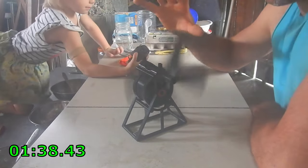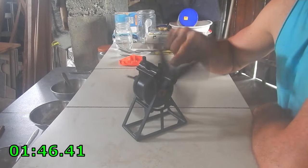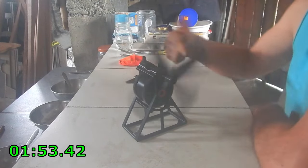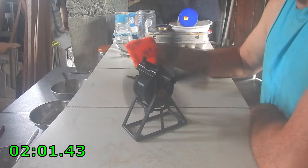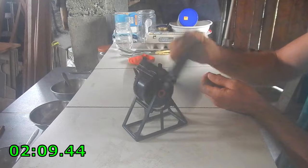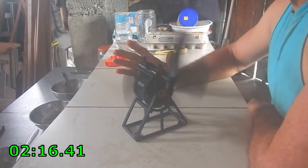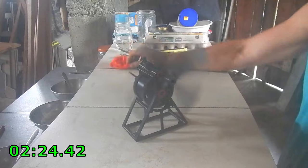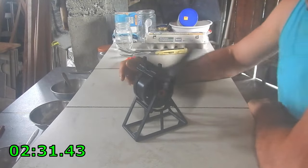Most of the parts here are 3D printed, obviously. The non-3D printed parts are five skate bearings — just standard size skate bearings. I wanted to use something that would be easy to find for anyone, and then the spring out of a tape measure. You should be able to use the spring out of pretty much any tape measure, because of the way it connects — I used a lighter to anneal the end of the spring to bend it to kind of lock it in there. I'll show how all that works, but this is just a test to make sure this is actually a good final thing that I want to share all the files for, so other people can make it. Then I'll make a video of putting it all together, getting a spring out of the tape measure, and how you connect it — and having the spring explode everywhere, of course — and then winding it back up.